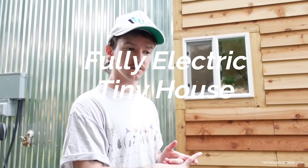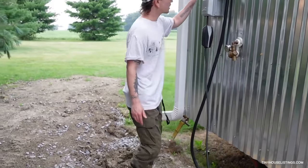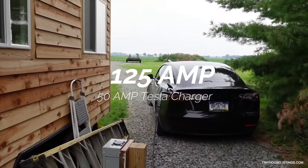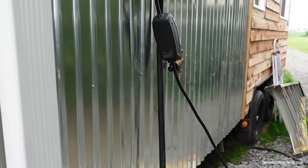The whole tiny home is fully electric — there's no propane or anything. I've got electric heaters, an electric water heater, and an electric two-burner top stove. Here are the breakers and here's my Tesla charger — just the regular Tesla charger that comes with the car. If I maxed out the amperage to 32 amps I could probably charge it in about three hours, but since I'm not driving every day I lower the amperage, which is better on the battery, so it takes about eight to ten hours.